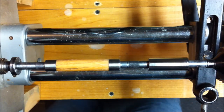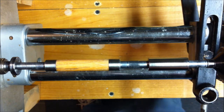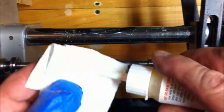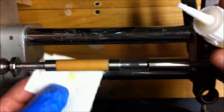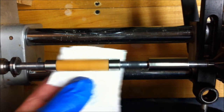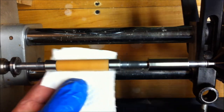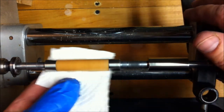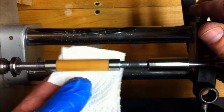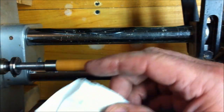Shake up the Shell-o-Wax. This is a nice shellac-based finish — the friction will cause it to bond with the wood, harden, and produce a nice protective shell. Putting that on, I'm basically just rubbing it back and forth to make sure I get good coverage. I'm going to press against the wood until I feel the heat on my hand. The friction is what you want — the heat builds up and causes the Shell-o-Wax to bond and form the shell.